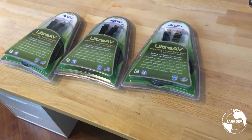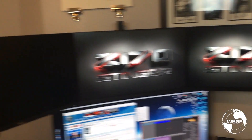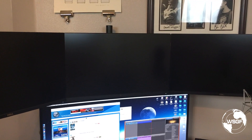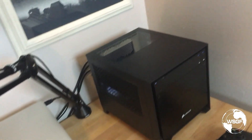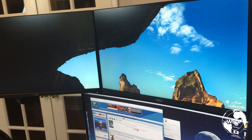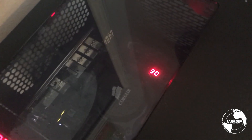So I picked up some new cables from Accell. I've got the three new cables in, no C code, and there she posts - and there's Windows. So if you're having some oddball problem and you can't post, can't figure it out, check your cables - they may have some sort of oddball grounding issue. And thanks to EVGA and the great debug LED on the Z170 Stinger. Thanks for watching.